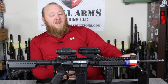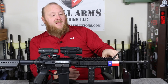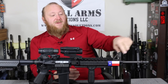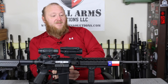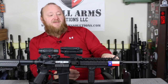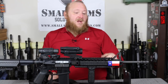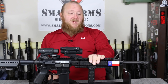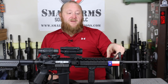The front sight base is also one of my staples. This is the Arms 41. This is a really neat front sight base because when you want to fold it, you just push down and fold it in place. And then with one finger, it engages. Now, when it's engaged, you have that triangular shape, which is sort of the silhouette the rifle is known for. And this particular model is pinned in place. This can be gotten in a couple different versions. One where you'll use a bolt or a screw to lock it in place. I tend to prefer drilling and pinning, as you guys hear me say all the time. So when I built this rifle, it was sent over to Monty LeClaire at Centurion Arms. I sent him everything, and he drilled and pinned the front sight base for me.